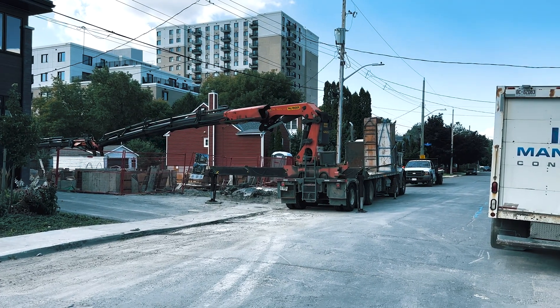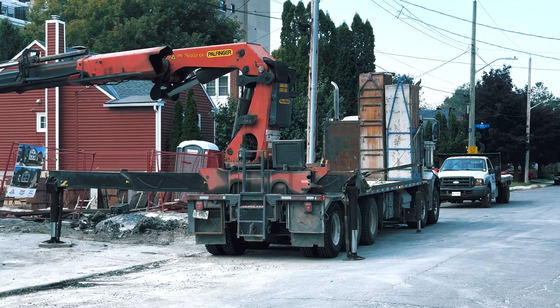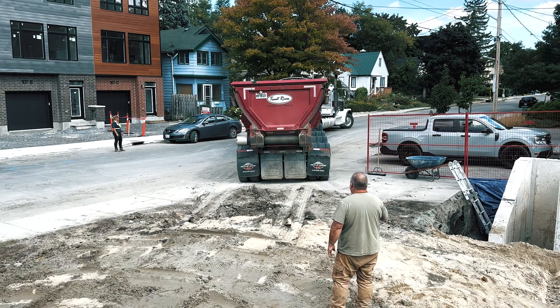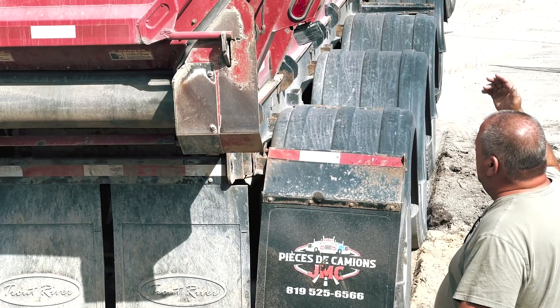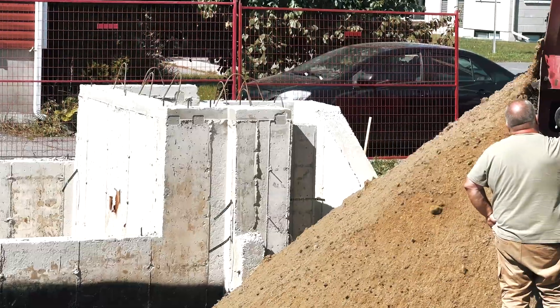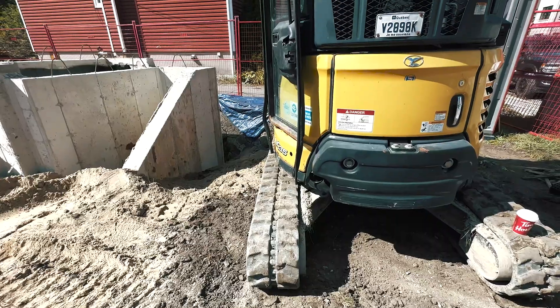This stripping process takes about a day. It's again 35 degrees Celsius, so the guys are working a little slower, but they need to get it done because leaving the forms on the concrete too long can start to corrode the non-slip face on the form surfaces. Once all the forms were stripped, we were ready for backfill. We brought in trucks of sand and filled in the garage and all around the foundation, and used a Mini-X to push stockpiled material from the back against the foundation.